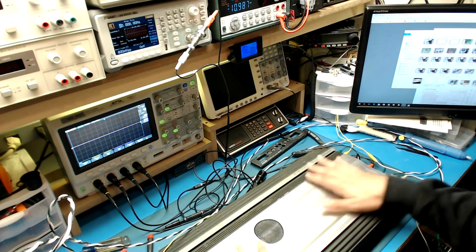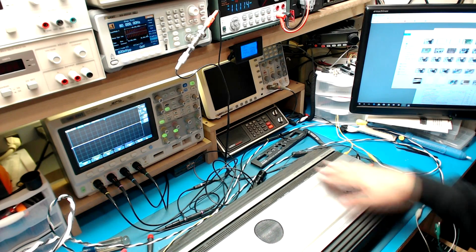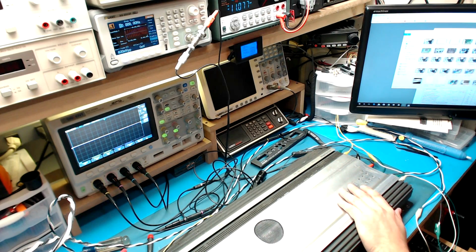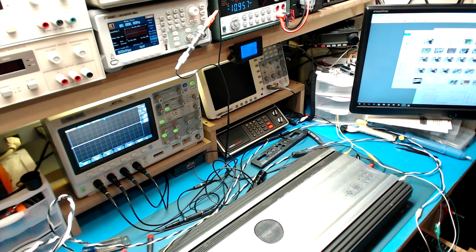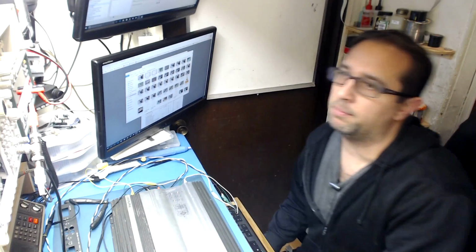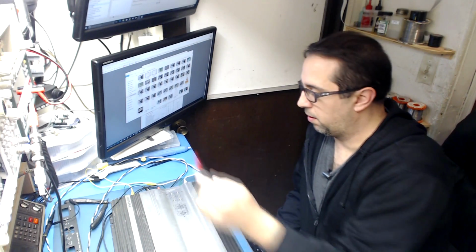All right, so I have it off the current limiting power supply and up to my trip light, and we're a little warm at idle. That's good. It's been sitting here for about 20 minutes just idling. Now we're going to hit it with some good current and let it become unleashed from its cage. Let's go to the other camera here. I'm going to do this slowly because I don't know what's going to happen. I'm hoping everything's good. I'm going to get the pots down to minimum and let's see how it works. Sounds good. Let's turn the gain up a bit.